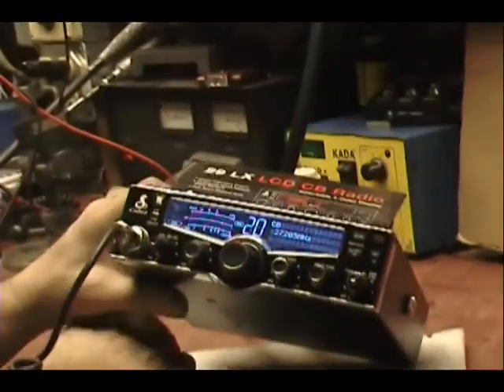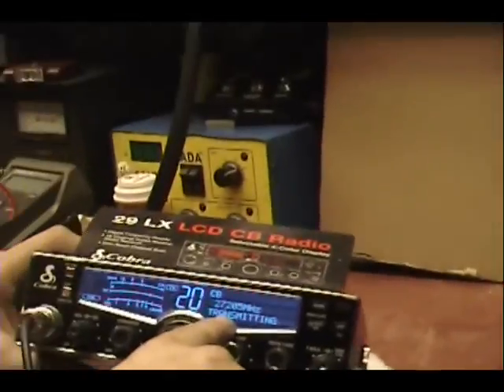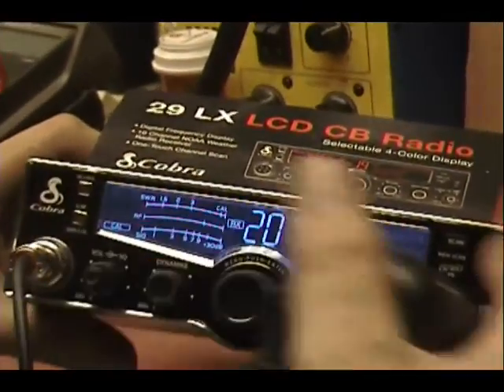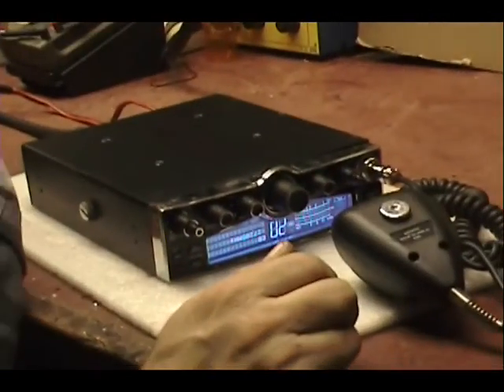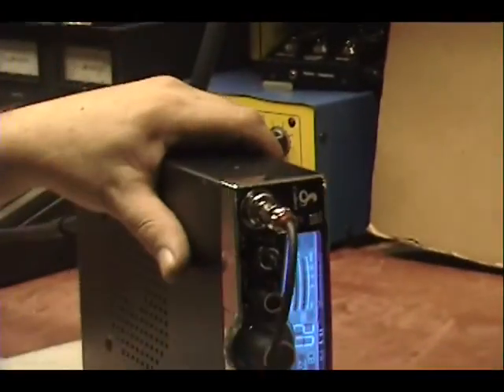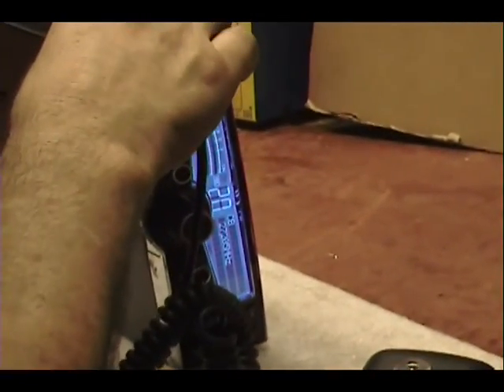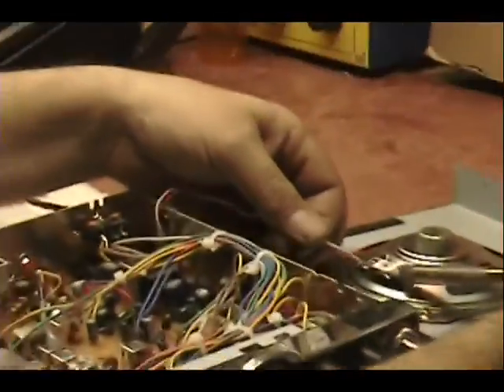Key to the mic — there's a little bit of signal there, and it says we're transmitting. That means my microphone is sending the signal; it received it and switched over to transmit mode, may have even squirted out a little bit of signal. I'm using a monitoring radio nearby on the same channel with the volume up — I can't hear it. So the problem isn't far down the chain near the antenna jack, or I would have heard it on that radio.